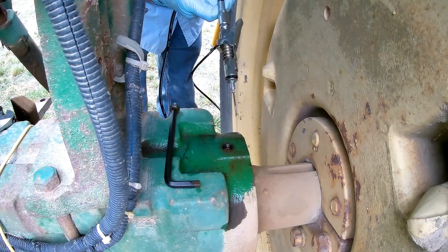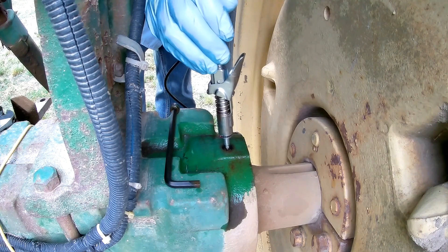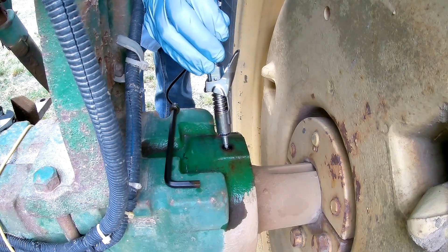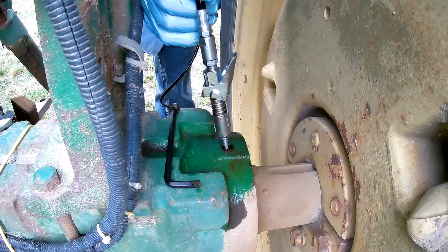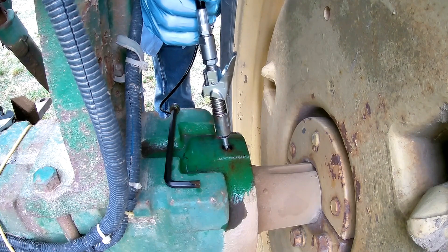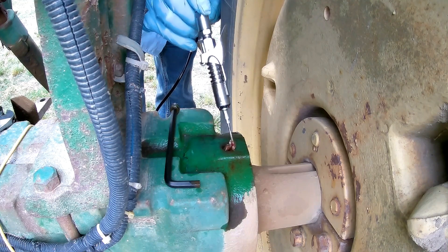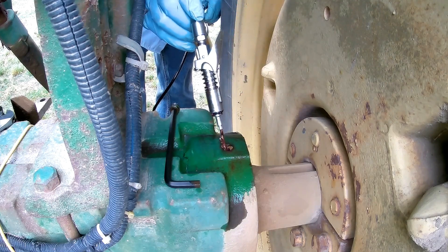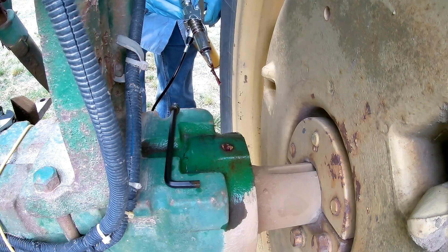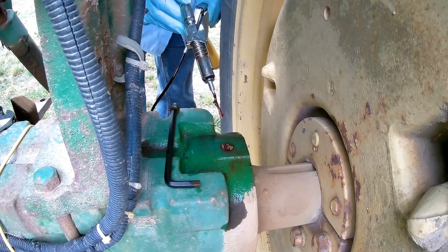What I'm going to do here is just stick this grease needle over in here like this, let it find the bearing there, and then start pumping in some grease. I'm not worried about creating an over-pressure situation, because you'll see in a minute what happens. And there it is — that's all I want to put in there. She's got plenty of grease now. It actually took about five pumps with my grease gun to get the grease to rise up like that. That's plenty.